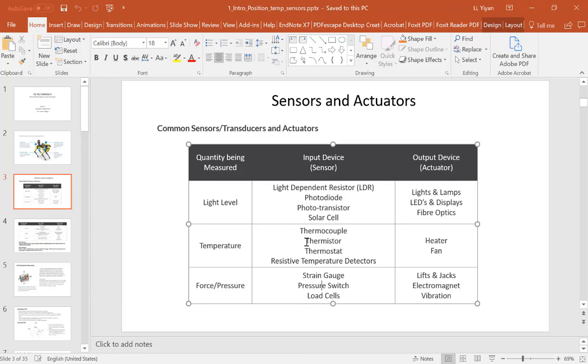There are 24 hot tubs in the resort, and the tubs are pretty close to each other. You have to have a cable actually. It's better to use a digital signal to communicate between the microcontroller and the sensor, because with a pretty long cable, a very low voltage will be changed by noise or by the long distance, which introduces a lot of resistance in the wire.